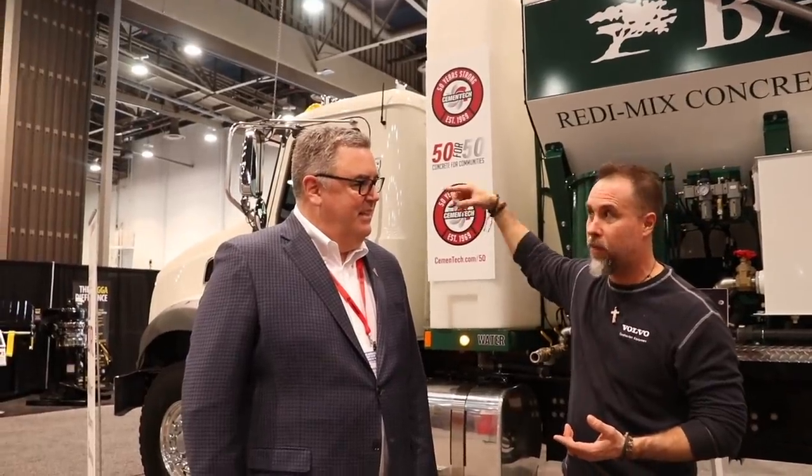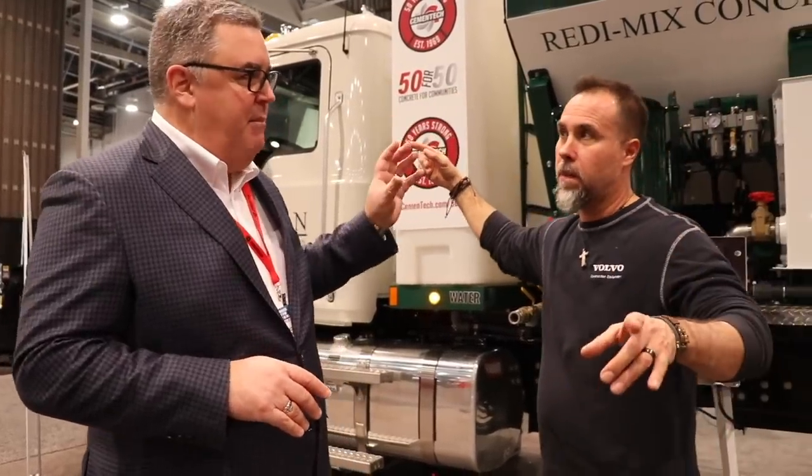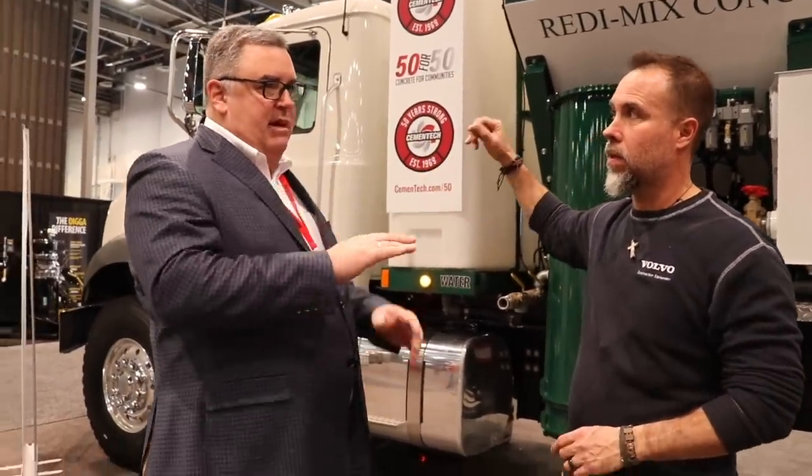So the slurry, it doesn't come as a pre-mixed slurry. Your operator can sit up in the control cab and figure out what he wants to do from one to the next. You can pour essentially whatever type of concrete you want in different batches, all out of the same group of raw materials. So the same sand, same aggregate. As long as that fits into your mix design, you have the flexibility to do it.